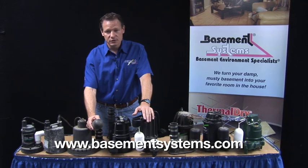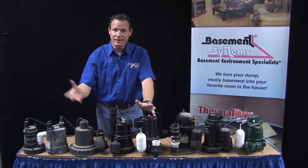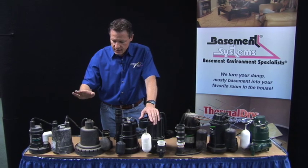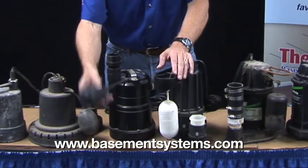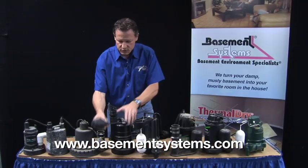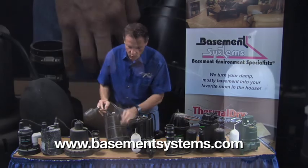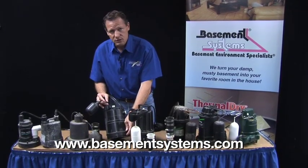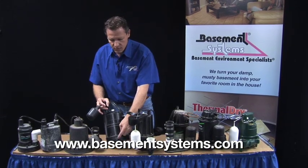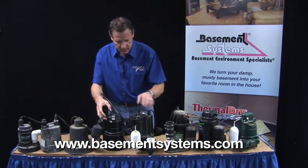This is not what you want in a sump pump. This might be better in a big tank where there's plenty of room for this thing to swing, like in a septic tank. This is also another example of the ball on a wire design — you can see how much space this thing needs to move. You also don't want a sump pump with a screen on it. See these little holes? They get clogged so easily with debris and dirt and mud.